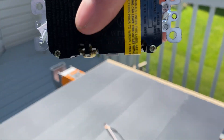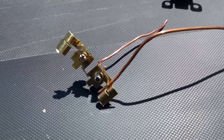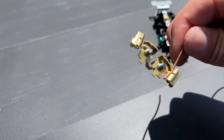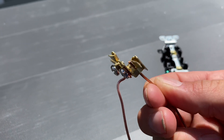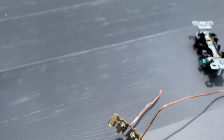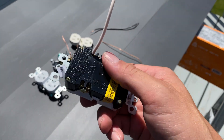Personally, I don't use the quick-connect or backstabbing option simply because it just doesn't look safe to me — let's call it risk management. And sure, you can see that it's tight, but at the same time you can see how it could possibly move if the outlet's a little bit loose or when people are adjusting the outlet back into the box. That could definitely move. After doing this demonstration, I've learned that I'm still not comfortable with doing the backstabbing option. I feel like there's just plenty of room for improvement. If I have the option to wrap it around the screw and get 100% contact, that's what I'm doing.